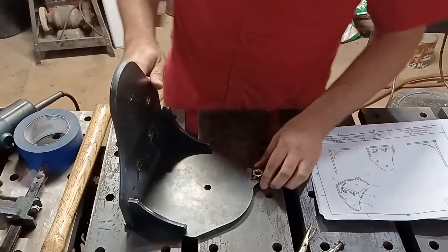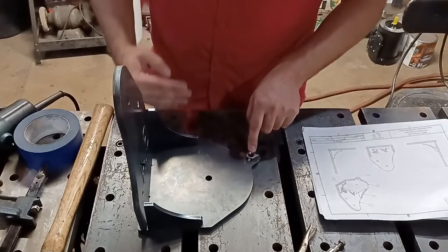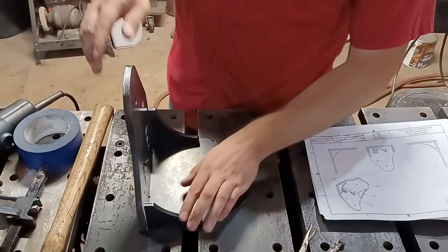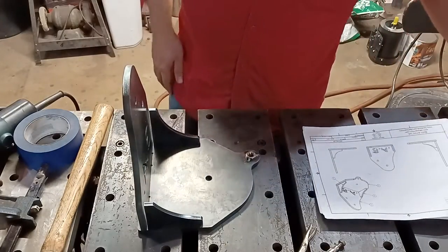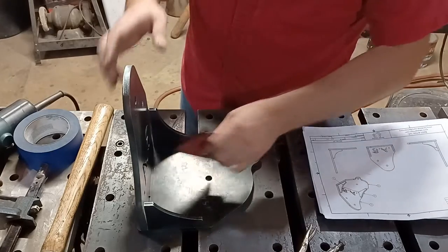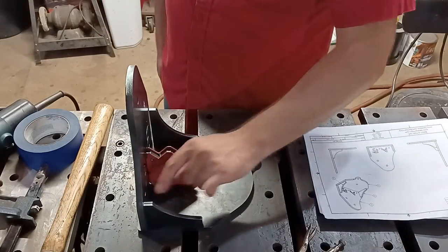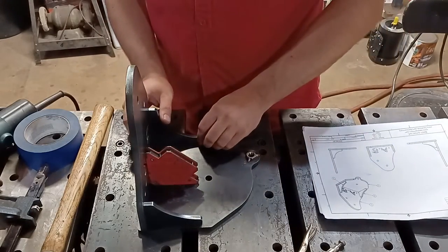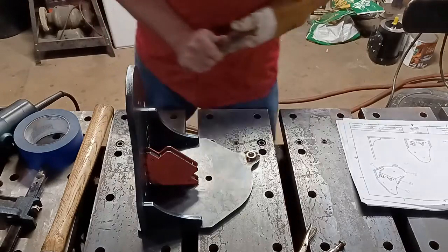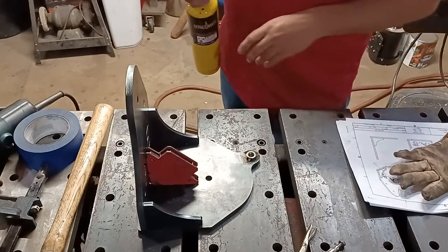You're going to have the large gusset on the back side, and the BA faces the outside. Now we're going to clean off our magnet, wipe any debris off, get it to 90 degrees, and tack the gussets. Always tack the gussets first before you ever tack an inside joint. This is three-eighths thick and this is three-eighths thick, so I'm going to preheat it a little bit here.